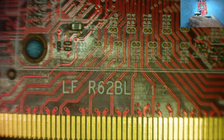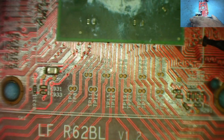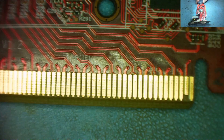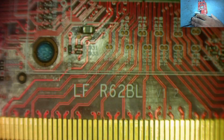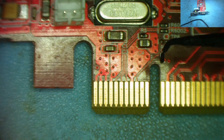These on the reverse side don't have any capacitors, as you can see. These are just test points, and they disappear under the GPU. So the capacitors are only on the other side of the board. To understand what these are and what they do - all these pairs of tracks that go to the GPU on both sides - we need to have a look at the pinout for the PCI-E connector.